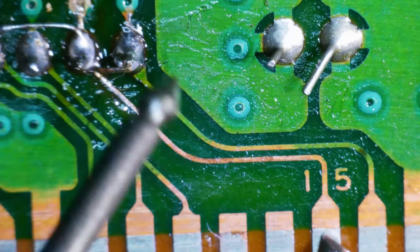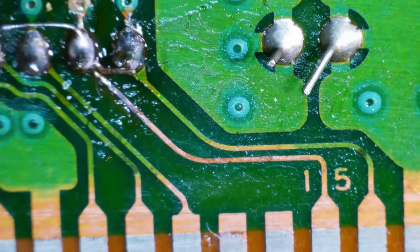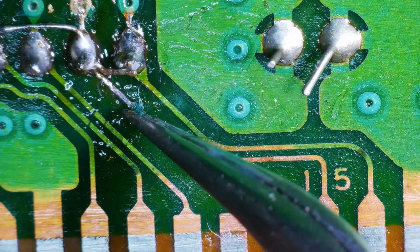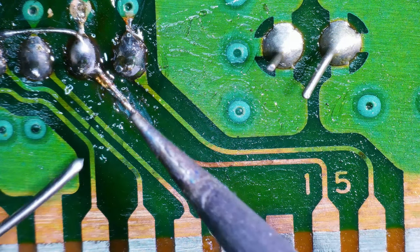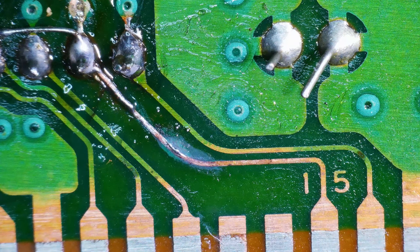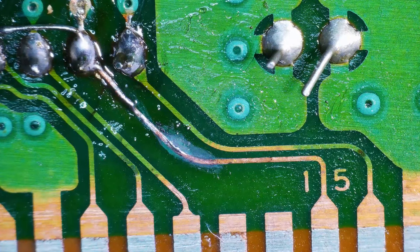Okay, well, why don't we put this wire back down and just solder that wire in place. Sounds like a plan. Because this looks like all the solder mask has been removed already. So, I'd like to scrape it a little more just to check. Okay, get the soldering iron in here. Now let's try testing continuity. Okay, now we have continuity.